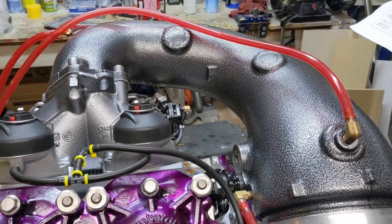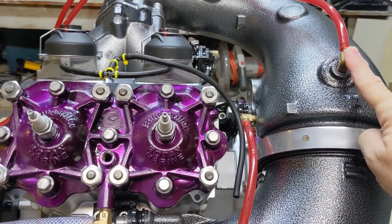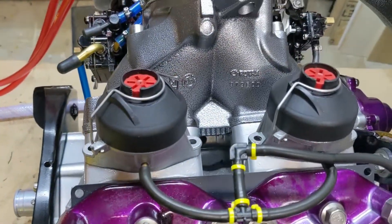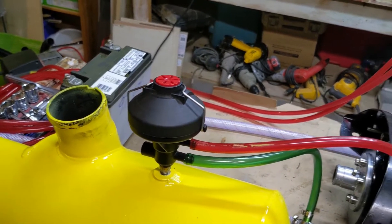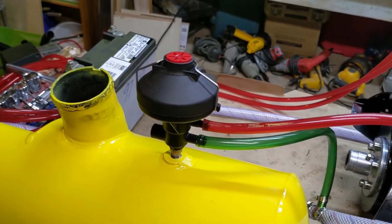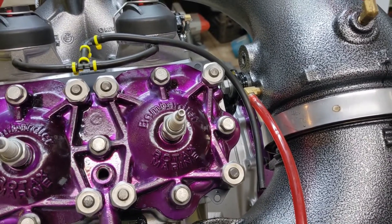In the 97.5 when the Gray Ghost came out, they had this fitting routed to a water regulator. It's not a RAVE valve even though it looks like the exhaust RAVE valves — some people mistakenly call it that. It's a water regulator and it basically does two things: it sprays water down into the water box, and it also controls the amount of water that goes to your injector.